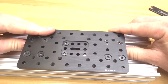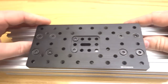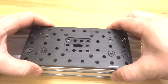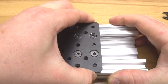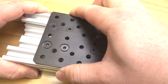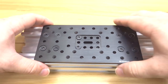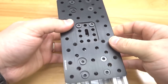I'm feeling the wheels on the inside — a couple are still really loose, so I'll adjust the eccentrics a bit more. I've got a good lock on the C-beam now with no movement on the gantry plate. If I pull up on the gantry plate, it's literally trying to pull the C-beam out of my hand — that's exactly what you want. Make sure to get it lock tight but not too tight; it's a matter of feeling the pressure on your wheel. It does take some time, but that's a nice lock with smooth movement.